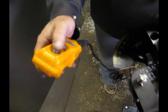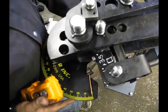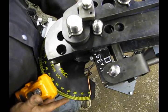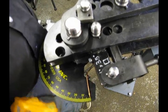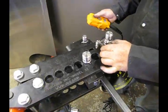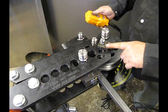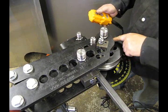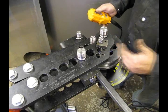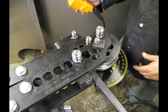Now we're ready to begin bending. We notice there's still a little bit of play in the die itself — we want to take that out by starting our hydraulic pump and taking out a little bit of slack. We take our controller and give it a little tap, and that'll take the slack out of the tubing. From there, we go down to our degree ring and set it at zero. We're solid, we're at zero, we can commence our bend. One last thing: we want to set our die lock pin — just let that drop down, and you'll watch as this die begins to rotate. This will lift up and drop into the next hole on the die, eliminating any chance of springing back. We're going to bend to 90 degrees.